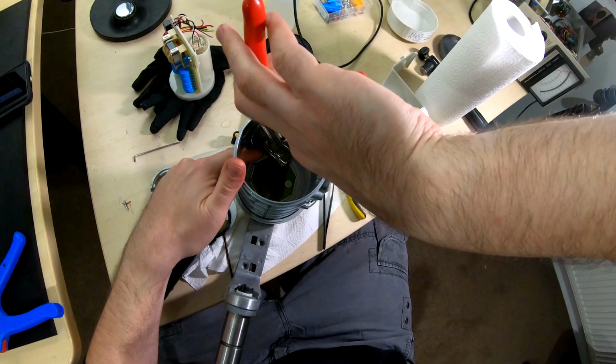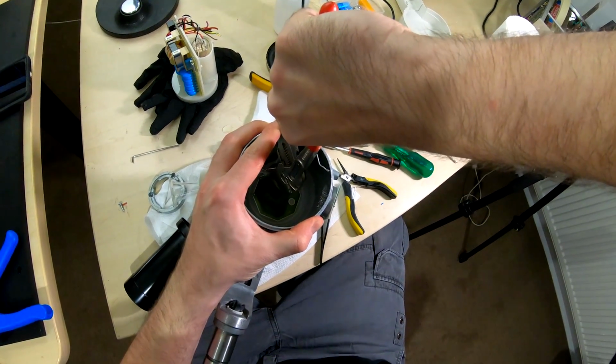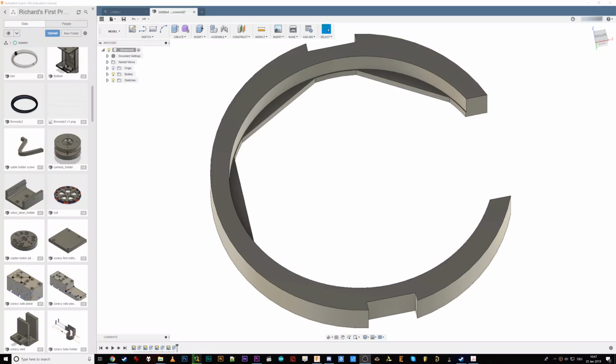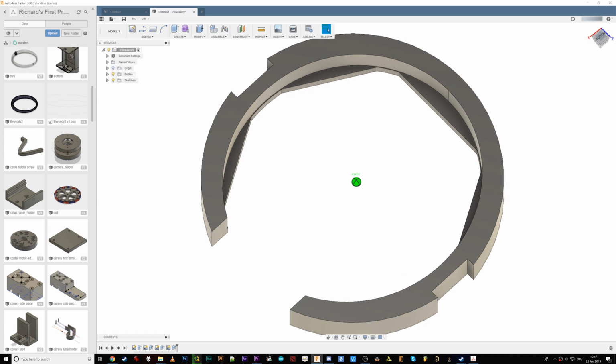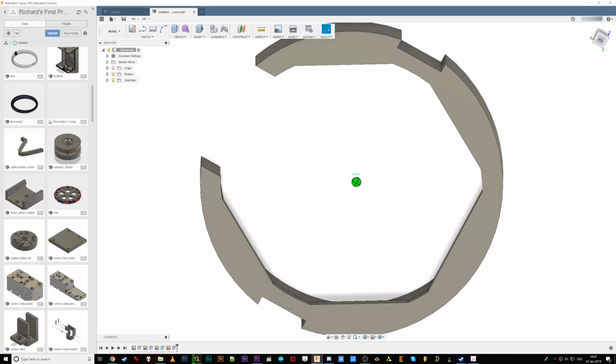plastic cup. I went right ahead, ripped it out forcefully, and it wouldn't fit anymore. Without it, the high voltage multiplier would hang around loosely in the head unit, and it could get way too close to the grounded aluminium walls. I 3D printed a replacement spacer with plenty of clearance and holes in it, so that mineral oil would effortlessly replace all the air in it.